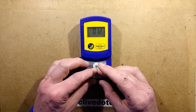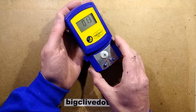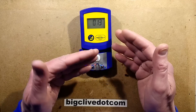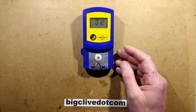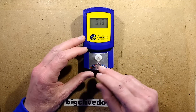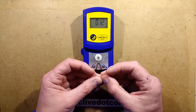Let's test this out first. It's got a thermocouple down here in the shape of a Y. These are changeable because you can only use it a certain number of times before it needs replacing and starts giving inaccurate readings. They quote 50, but I don't think it really gives that many. The device uses a thermocouple - two different metals joined together in a crimped or bonded junction.